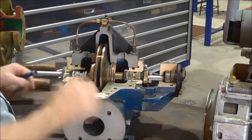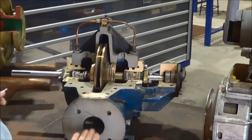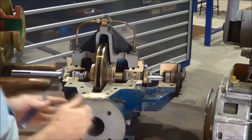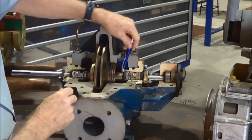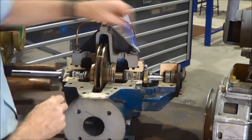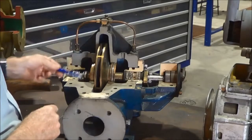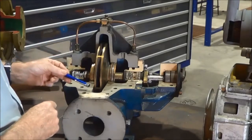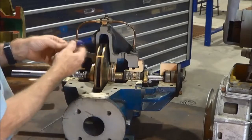Having a look at this pump, it's a horizontally split pump. We've got our suction coming in through the middle, then the casing splits the water and it enters into the impeller on the right-hand side and on the left-hand side, and then the impeller rotates around inside the housing — that's your discharge around there.